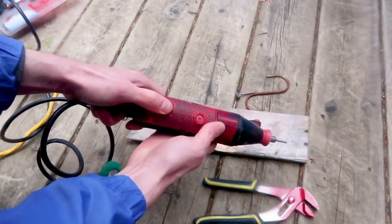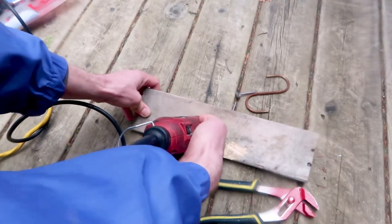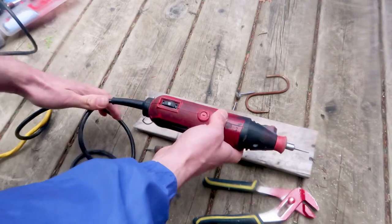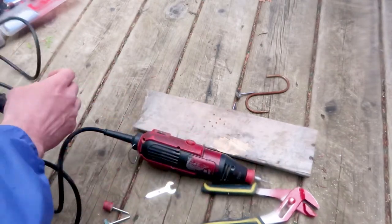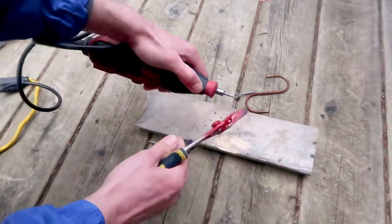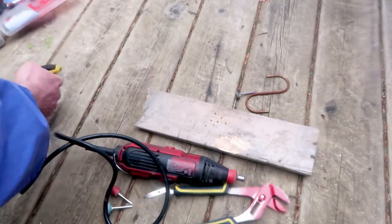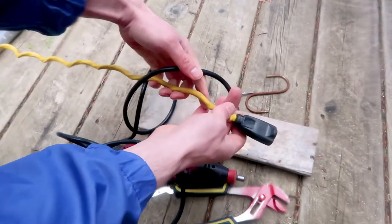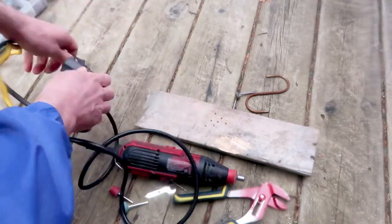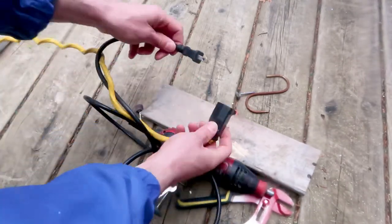Some bits can be used at really high speeds, like the drill. With wood, a drill bit can be almost completely dull and just because it's going at 30,000 RPM it'll basically burn through the wood — you'll see smoke, but it'll burn a hole right through. The key with a rotary tool is not to force it or push hard, unlike a regular drill. You let the speed of the tool do the work. You're very gentle — not forcing, not pushing hard — just patiently waiting for the RPMs to remove the material.